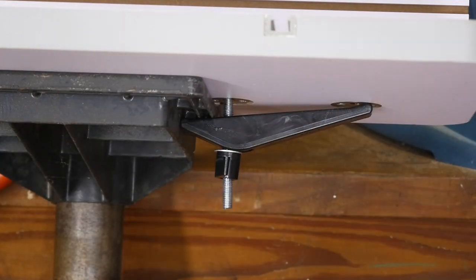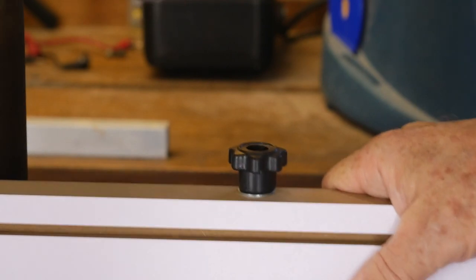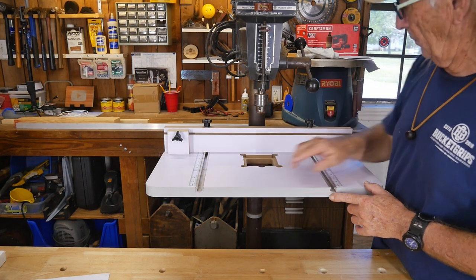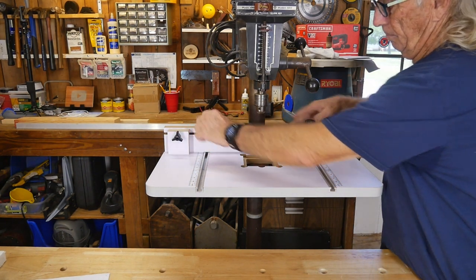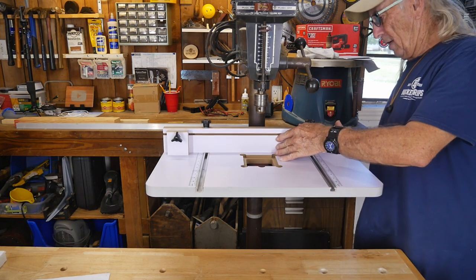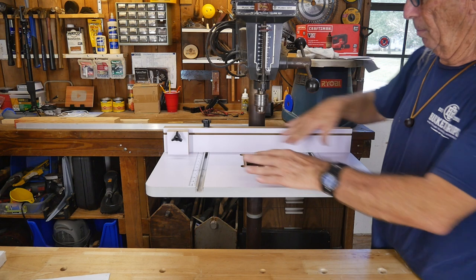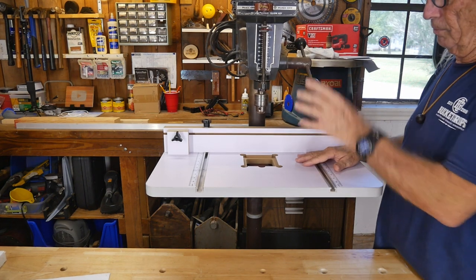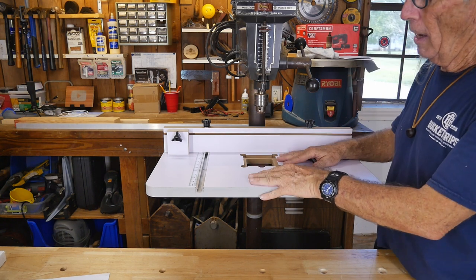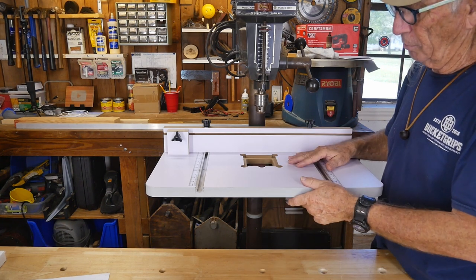I put the drill over on an angle, leaned it back to the workbench so you could get a good look at the clamp set that comes with the kit. I've screwed this up into the bottom of the table with the shaft. You have a T-nut that you can tighten up with a washer, and I've got these set at the exact same distance back to the table, so it's pretty much square with the old metal table on the drill press. It's held really well. If you want it out of the way, just loosen the two T-nuts and you can slide it out. Back on top, there's a scale on each side of the track for when you set the backstop. It's very customizable. I'll provide an affiliate link in the description below.